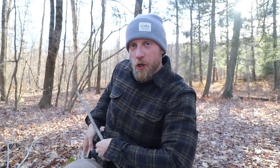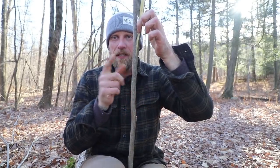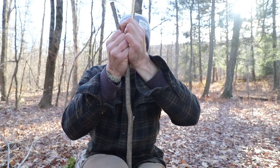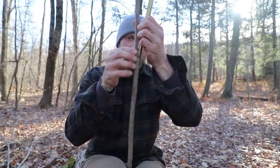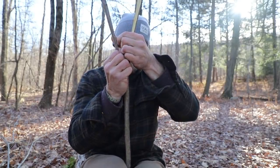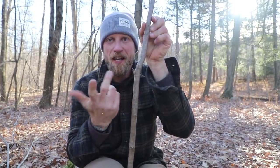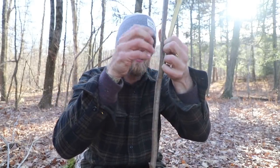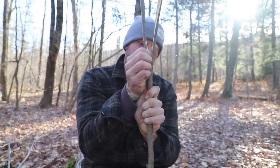I'm going to take my knife and start to split this longer one out. Once I'm far enough into my split, I'm going to pull whichever side is opposite the runout. In this case the split's starting to go out this way, so I'm going to pull with more strength this way and pull that back to center, then just keep working down. Knots are always tricky — when you get to a section with a knot or branch area you really have to focus. Try to keep support on both sides, and you can definitely make it work if you just take your time and embrace this technique.